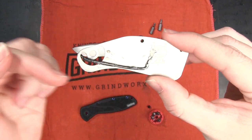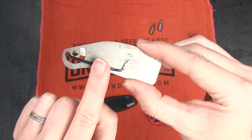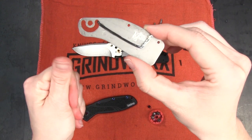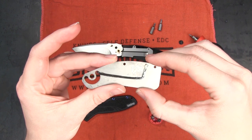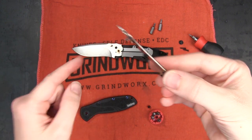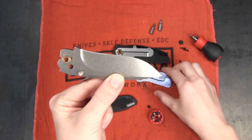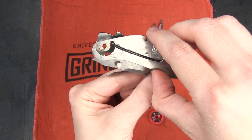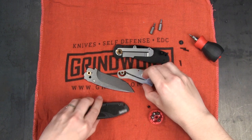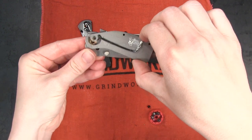We have the liner, which has this half-circle-shaped opening in it. This circle right here is where the pivot screw goes through the blade to the other side of the knife, and this is the spring that is responsible for all that snappy action. There's a lot of lubrication in there to keep it moving smooth. The spring has a little tab that protrudes to the other side — this little tab goes into this little hole on the blade. So when the blade is closed and the spring is connected to it like that...